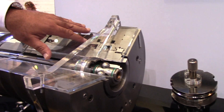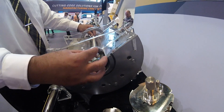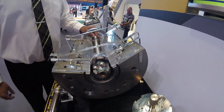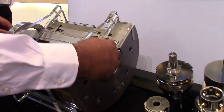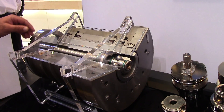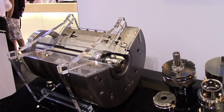When you get a spindle overload error, it's because the bearings don't want to spin. With a higher bending moment, the tool wants to stay flat — it doesn't want to cock to a side. So that in turn keeps everything balanced and symmetrical inside of the spindle, which lets it spin freely and reduces spindle overloads.